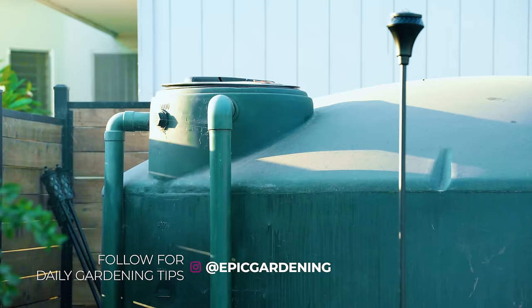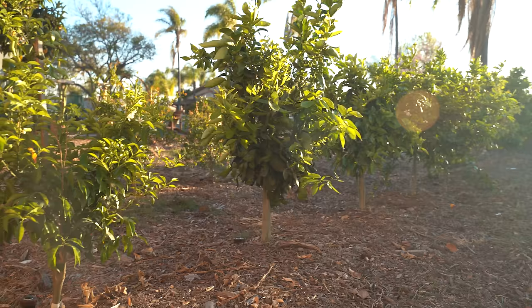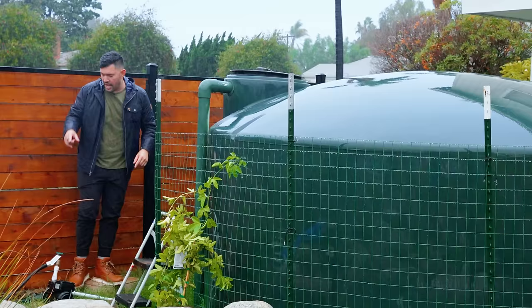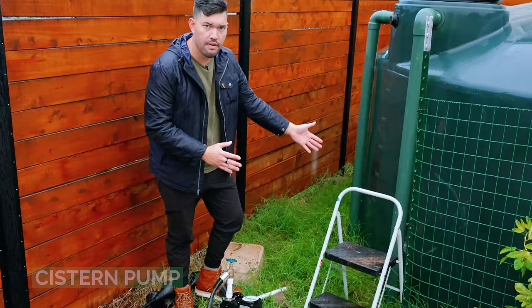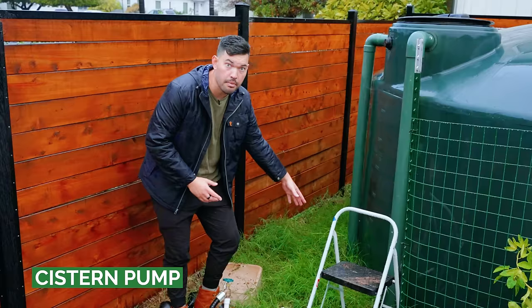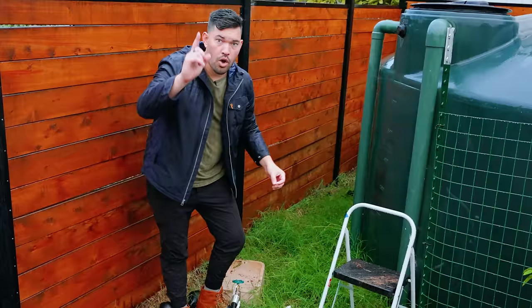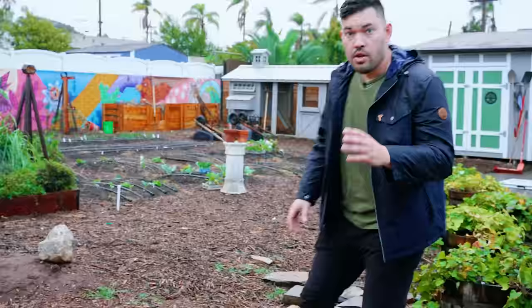With rainwater capture, it's all about redundancies and contingencies. If I didn't use enough water and it's raining like crazy and this cistern is going to overflow, it also has an outlet that can gravity-overflow into my citrus orchard in the front yard. But if I'm really in a pinch, I have a pump right here. There's a valve down here that feeds into this PVC pipe — that's a gravity-fed method because it's at the bottom of the cistern. If I turn this nozzle, it allows water to pass through the pump, which triggers the pump to turn on, and over there a hose starts pouring water out.